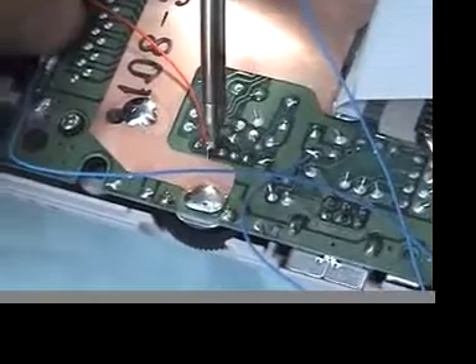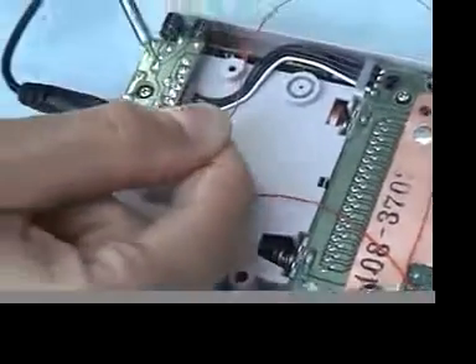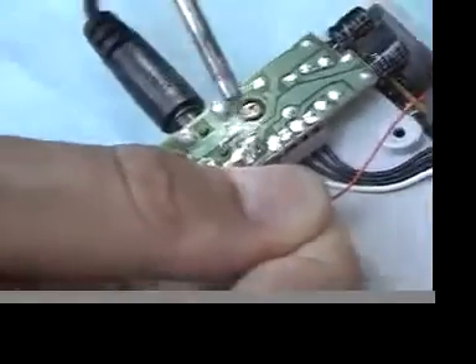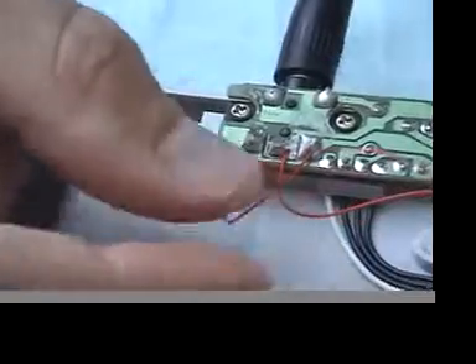I'll use a different color wire. So those last two in that row there — here's a little drawing of that. This is the volume potentiometer, and what you're doing is bypassing this volume potentiometer directly into the jack. Those are done. The final step also involves cutting two of these wires. We should still have sound, except this time it will be the ProSound.